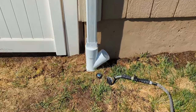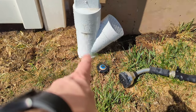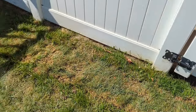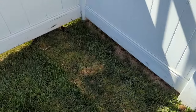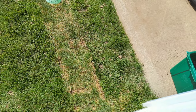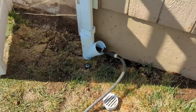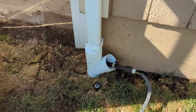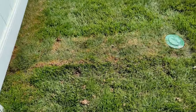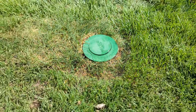Final product: the cleanout wye with the grate is cut in. The sprinkler head has been relocated from right there to here. The sod that was cut has been replaced, backfilled, tamped level, and watered. Outside the gate, sod replaced, running out to the pop-up drain. We're going to do a little test — got the hose in the cleanout, running it down the pipe, and out to the pop-up drain. Water is draining out just as we hoped. Excellent.